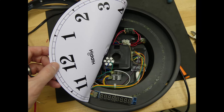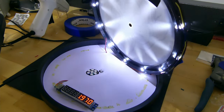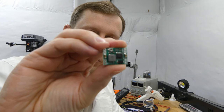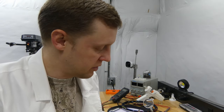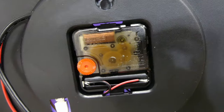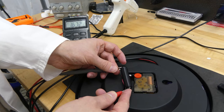I reused the original clock face as a cover for the electronics. This also helped illuminate the face by reflecting the backlight. Because there's already 5 volts going to the clock, I'm going to install this fake battery that was 3D printed, along with a little step-down module so I can convert the 5 volts to 1.5 volts, giving it unlimited power for the clock motor. This voltage regulator works okay but it's extremely sensitive to adjust — the closest I could get to 1.5 volts to emulate the AA battery was 1.6.